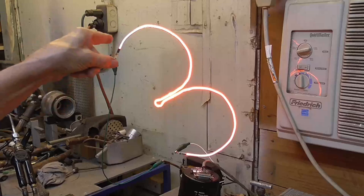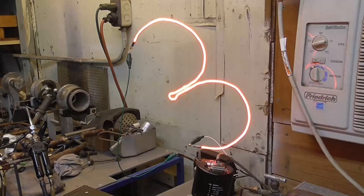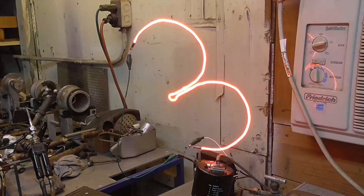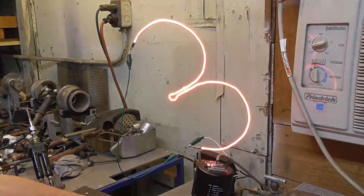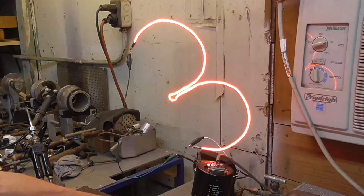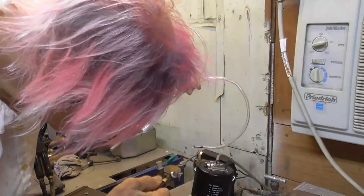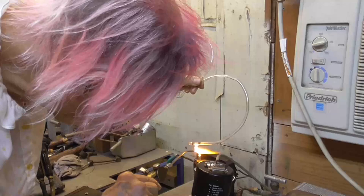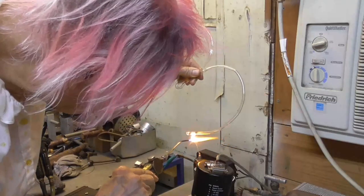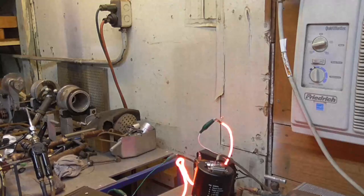Go ahead and bake out the electrodes. Right. Okay, we've got this one processed and it looks pretty darn good. Okay, that's 2 torr. Let me see, I'm going to run it up to 4.93. That's good enough. That's beautiful, beautiful. Gorgeous.